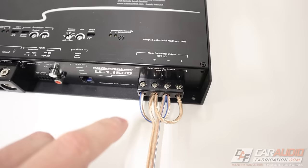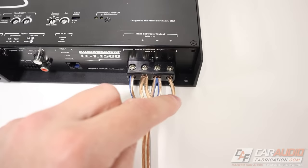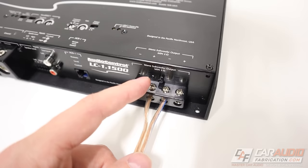As we've just tested on an amplifier like this, the negative terminals are wired together and the positive terminals are also wired together. To visualize this, we can just add little jumper wires like this. Do note that this is just for illustrative purposes, so that you understand positive is connected to positive, negative is connected to negative. We don't need to do this with our wiring — this offers no performance benefit.